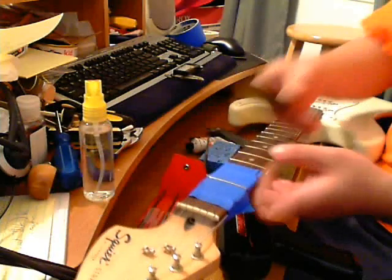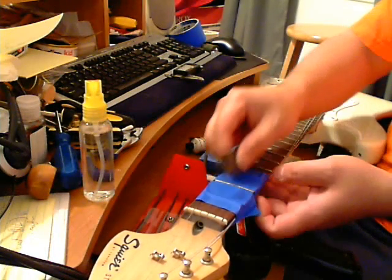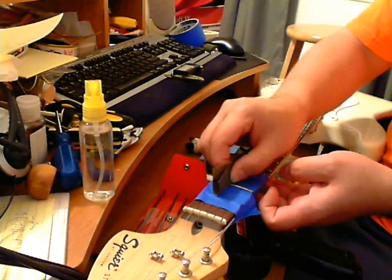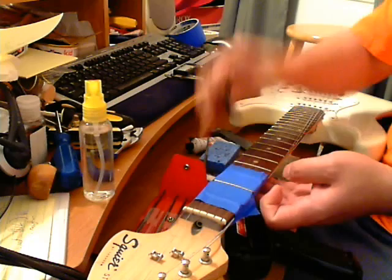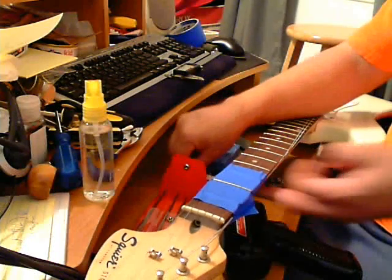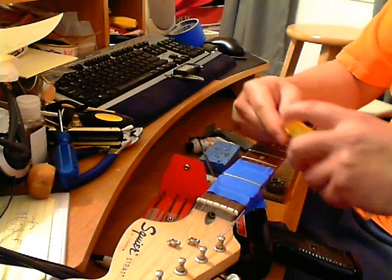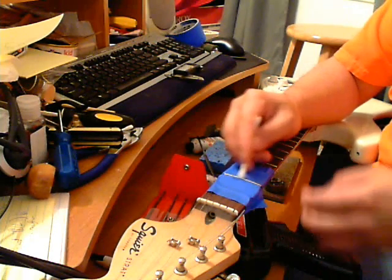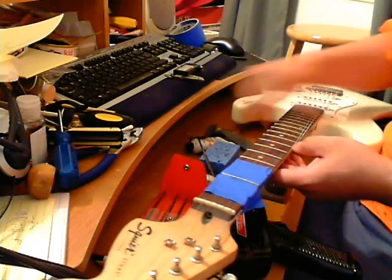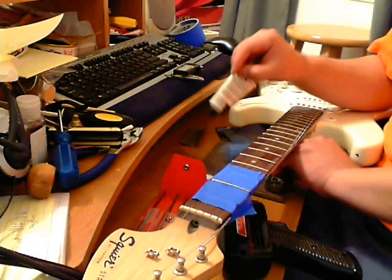the sandpaper, 600 grit. Hold it to a crease and just very lightly clean out the notch. Just one or two passes is enough in case there's any dirt or oxidation in there. And then you clean it off again. After that, I'm going to take the paste flux.